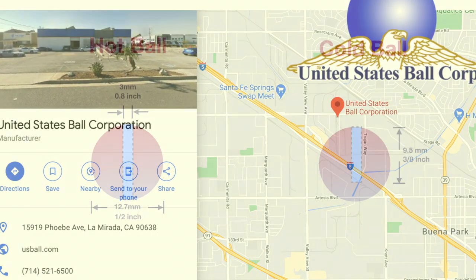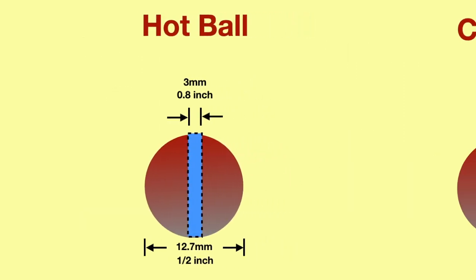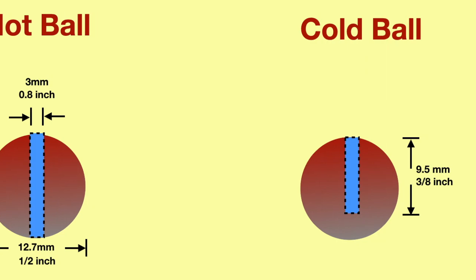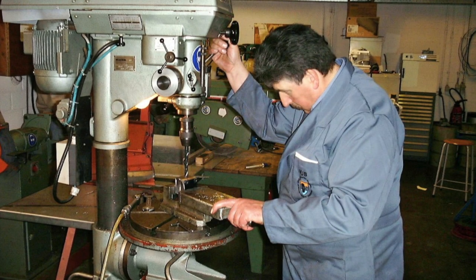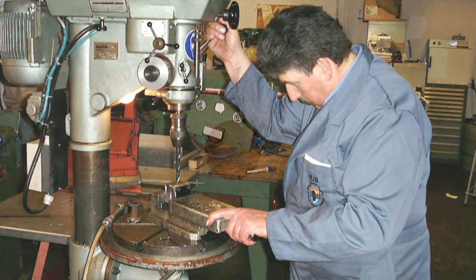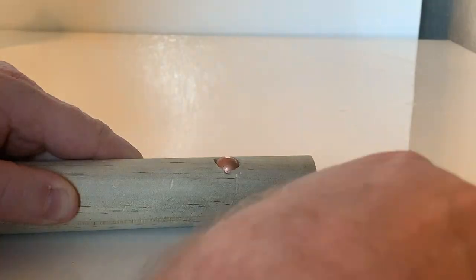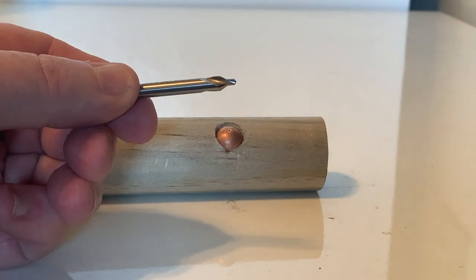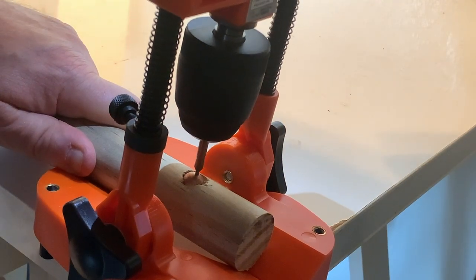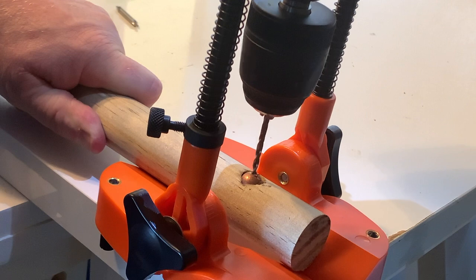You'll need to drill a one-eighth inch, or three millimeter hole through the center of both spheres — one all the way through, and the second three-fourths of the way through, or three-eighths of an inch deep. It's hard to drill a small rounded part because the drill bit tends to slip when you try to start the hole. The secret is to first file a small flat spot on the top, mark the center with a center punch, then start the hole with a center drill. After that, drill the hole with a little cutting oil, at high speed, cutting just a little at a time, and removing the bit to clear out debris before continuing.